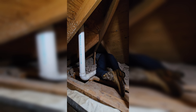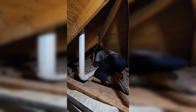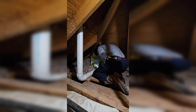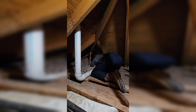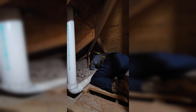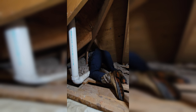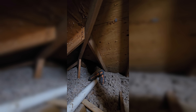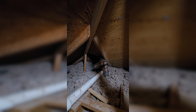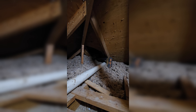We're here in an older home that's been remodeled. The AC unit is behind that wall right there in the middle of the room, so it is a little loud. We also have poor airflow throughout the bedrooms. We're trying to find a good fix for that. Basically you start with needing better return — more intake — so the unit can obviously push air out to the grills in the bedrooms.